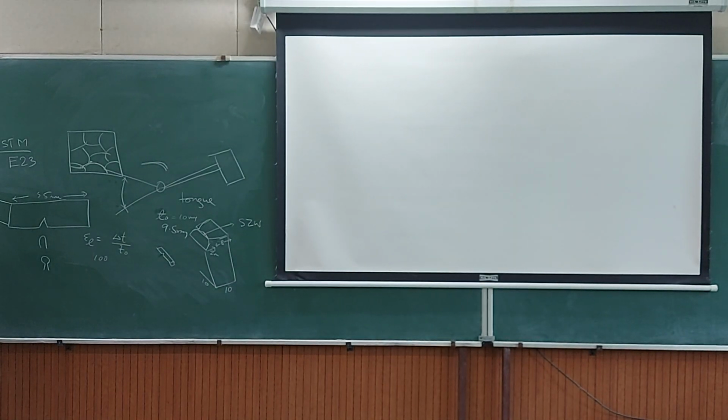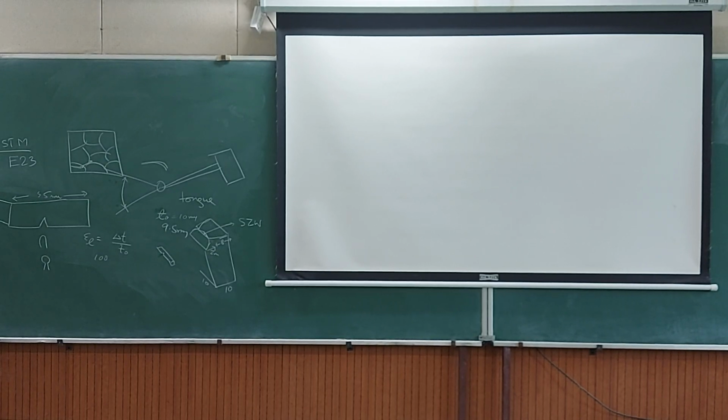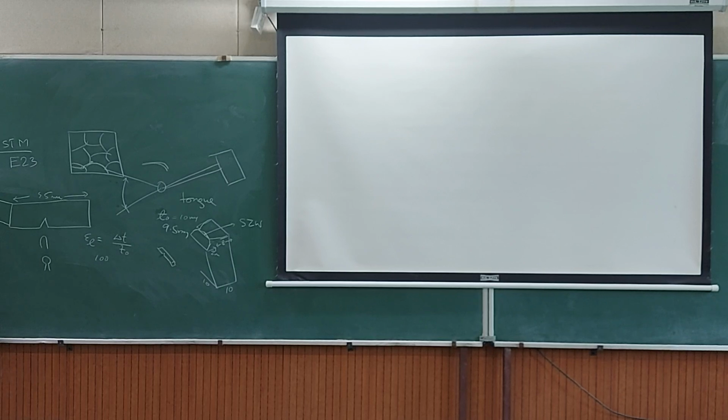And then you can also do fracture toughness testing with this specimen with the same apparatus. What you have to do is, for fracture testing, you need to measure displacement and force both. That is what you get in a UTM when you do quasi-static loading. In a Charpy test, you don't get any value except energy.